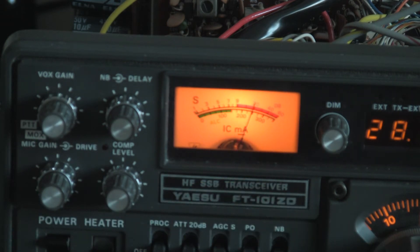The S meter is generous up to S9 and then stingy once you get above it. So that's a couple of tests we've done on 14MHz and 28MHz. I've actually checked it on the other bands and it's much the same. If I get a chance I might do some more recording of the other bands. And as you can see the frequency accuracy is pretty good.